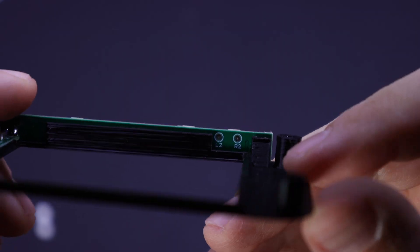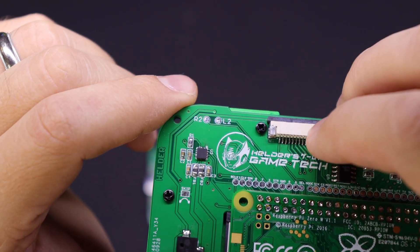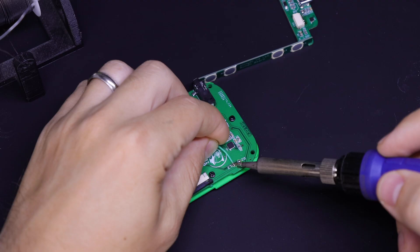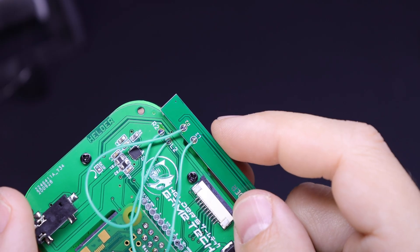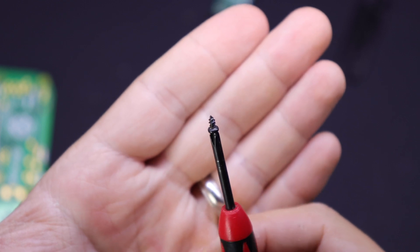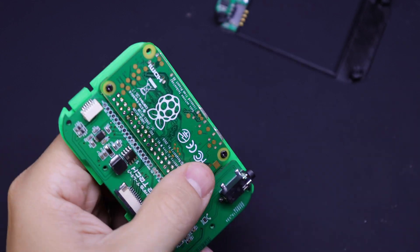If you are doing L2 and R2, you'll need to connect a couple of wires from those points on the L and R button board to the main PCB. We were already using all of the wires going from the power board to the button PCB, so doing it this way lets us use those same connectors and keeps L2 and R2 optional. You just need two pieces of wire a few inches long — I used 30-gauge silicone-coated wire. One last thing: I'm using a different style of screw in the kits this time — self-tapping, sort of like wood screws, instead of the laptop-style screws with a tiny thread pitch I used before. They go in much easier with far fewer turns, so it's a lot easier to put together.